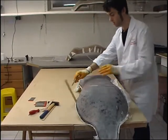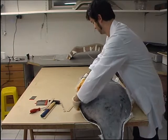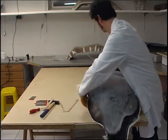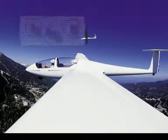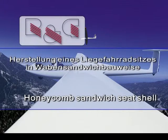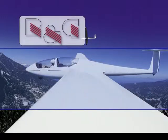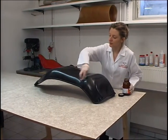When the mold does not exhibit an undercut and has previously been treated thoroughly with release agent, the molding should not cause any problems. To separate the mold and master pattern, you can first use a soft wooden rod. New molds must be thoroughly waxed separately. The mold is waxed several times before they can be used to manufacture the first components.